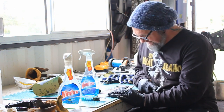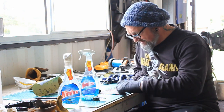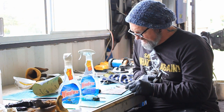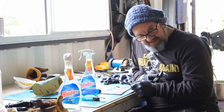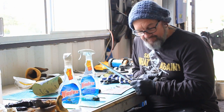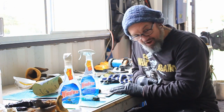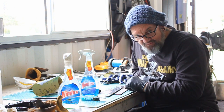and we're gonna sand. So there's gonna be no hurry and no rush. We're just gonna sand that quite nicely till it's nice and flat, gradually going up in grit till probably 1200 before we do any heat treatment on the blade. Want to make sure there's no scratches anywhere. Because if you have a scratch now, and then you heat treat it, you try and get that scratch out, it is crap. You'll be rubbing for ages and thinking, gee, I wish I spent 2 more minutes and rubbed that little scratch out, because now it spoils the whole blade. So if you see a little scratch in this bit, get it now, don't wait till later.